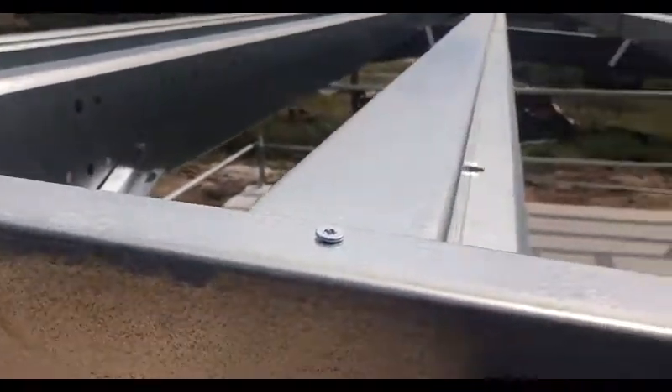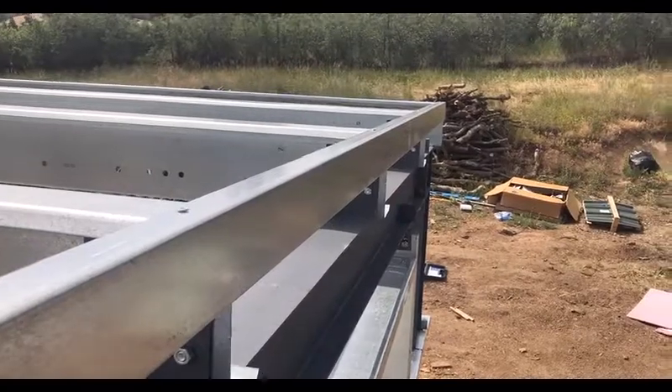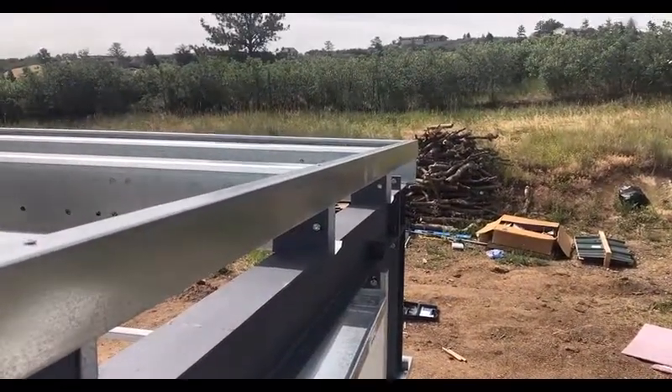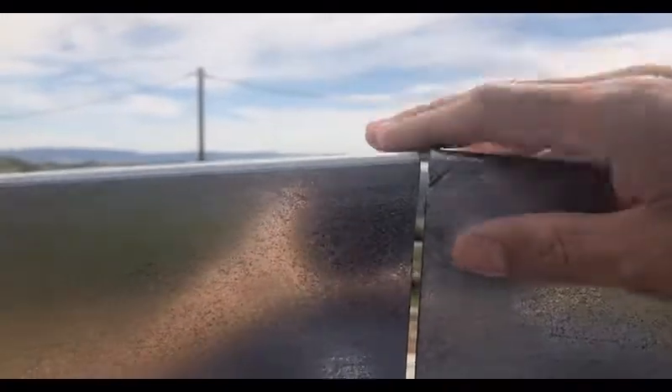You want to put one on each purlin, as far down to the eave strut as you can get it without it overhanging at all. There's really no reason to miter it at this location. On this job the erector went ahead and mitered it so that it gives a nice peek.